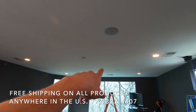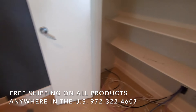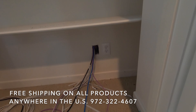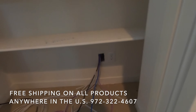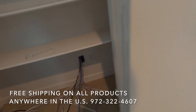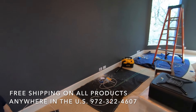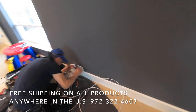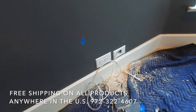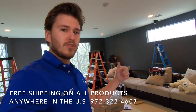While I was gone, the guys already got the in-ceiling speakers put in as well. These are the Martin Logan ICs — they look really sharp. Down here you can see we got all our wiring dropped; this is all 14-gauge running to all the speakers. I got this marked, we're going to get this knocked out, get our rack brought up, and power outlets put in all the way across the front for all our speakers. Everything is nice and level, just like it was put in by the builder.